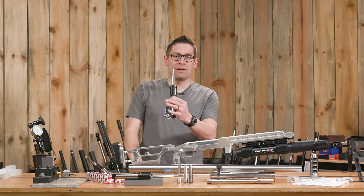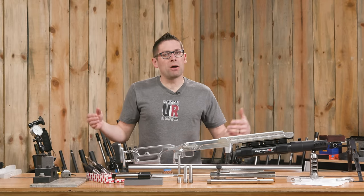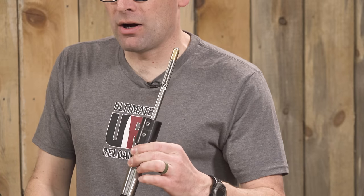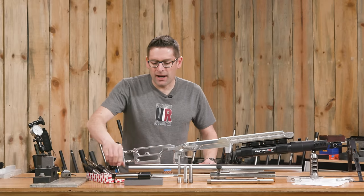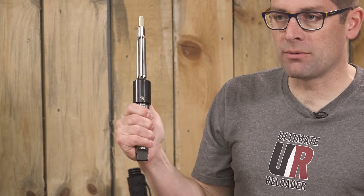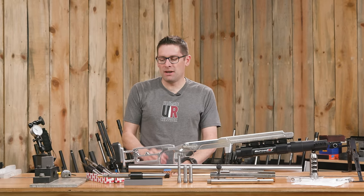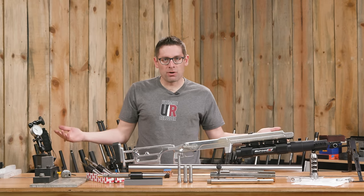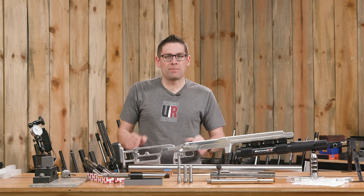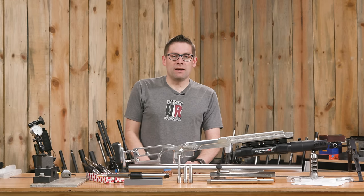7/16ths is the US standard for reamers. Almost all centerfire reamers until you jump up to something like 50 BMG are going to be 7/16ths. But what about when you want to use something like Treble reamers from Germany? 12mm would be your standard centerfire cartridges, and I've got a 50 BMG throater here, plus a 50 BMG with an integral 18mm shank. We can just as easily make a metric rigid reamer holder as a SAE 7/16ths one. These blanks are just Morse taper number 4 blanks with a tang — I got these online for about $16.70. Some specialty tool holding from Europe can be upwards of $500 to $800 plus. This is extremely affordable.